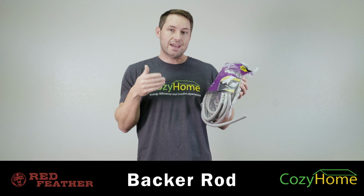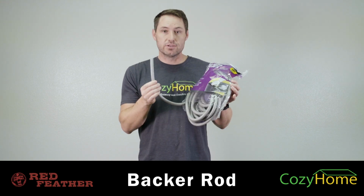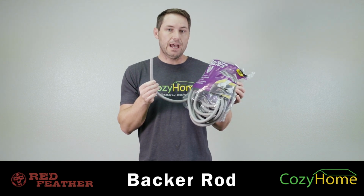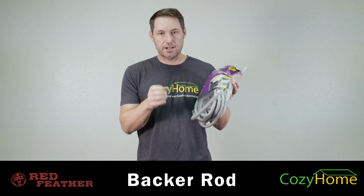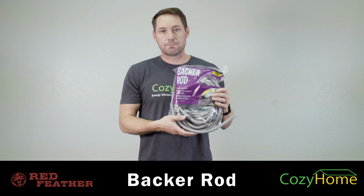And if you have a gap more than a quarter of an inch wide, you actually need to make sure you're using this instead of just using caulking, because that caulking will fail if it's a big gap that doesn't have backer rod behind it. But this is a real versatile stuff, and it's really cheap as well, so you can use it for a lot of different purposes.